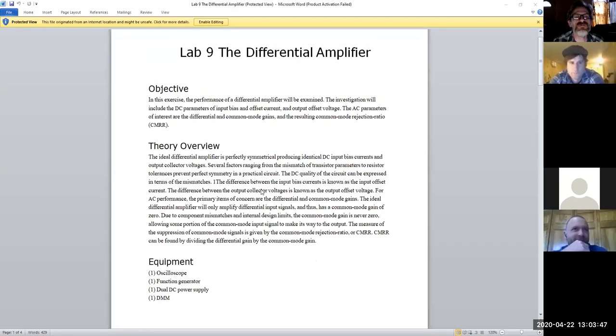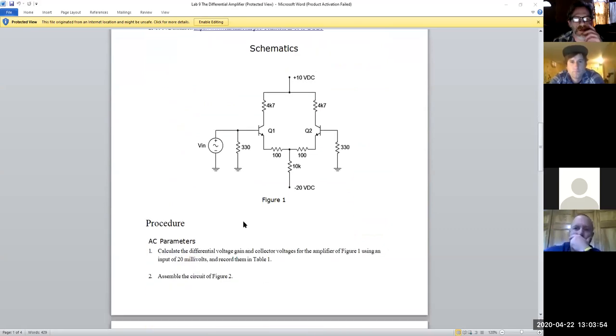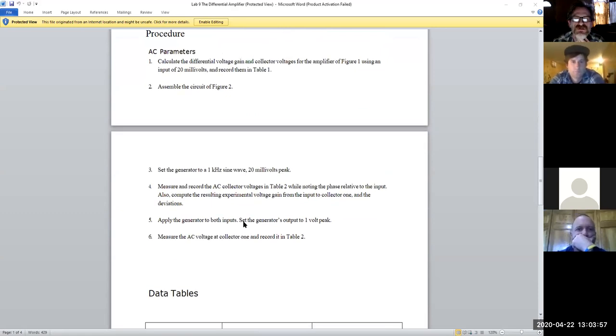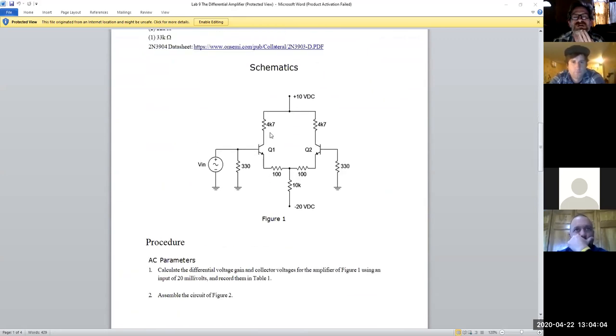Well, it should be fairly straightforward, doing a differential amplifier. And I think I did this fairly well, so it shouldn't be too complicated. Remember, when it says VC1 and VC2, it's referring to taking your collector voltage readings here. The only reason I found this was somewhat important is that the op amp incorporates both this amplifier and the class B power amplifier. It's sort of like a hybrid of the two amplifiers together, right?